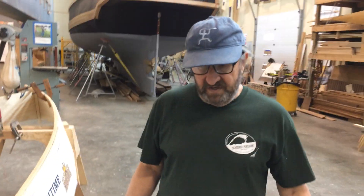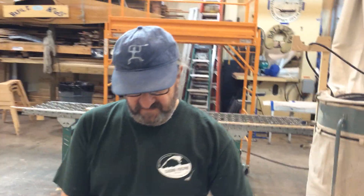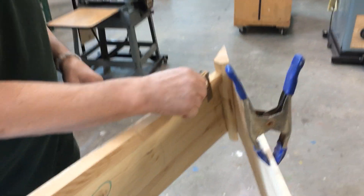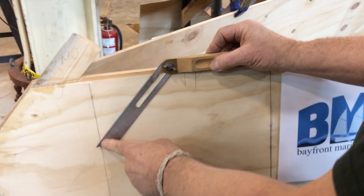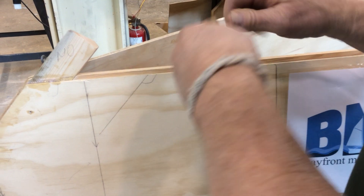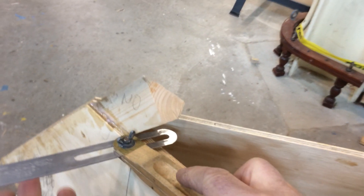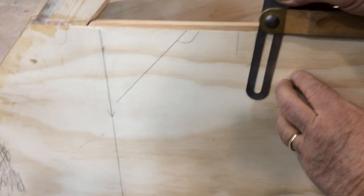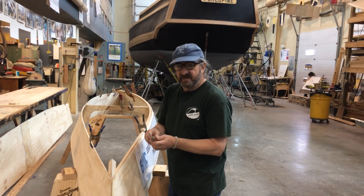What we're going to do today is cut — and we'll do it by hand with a handsaw. We're going to re-cut this end and cut 14 and 1/16 inch off. We took a bevel gauge and copied the angle on the front and drew it on the side of the boat with a pencil so we could reproduce it. There's another angle too, because remember it's a compound bevel. We copied both of those angles on the boat so we can put them on this piece and cut it with the handsaw.